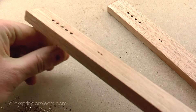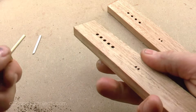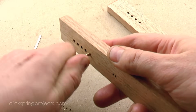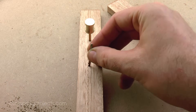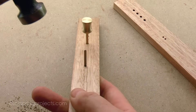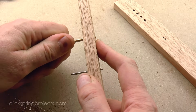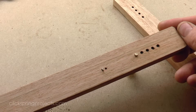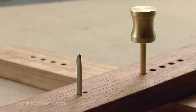The pivot can be easily repositioned within the trammel, and the depth of cut of the scorper can be adjusted by simply tapping it progressively deeper with the hammer as the cut proceeds. Now of course the spirals each have a slightly different geometry, so I decided on the least complex solution of a separate trammel for each. But it's not difficult to imagine a slightly more evolved version of the tool, closer to the modern universal trammel, that could plausibly have been constructed in the period. Regardless, it's a very straightforward and cheap set of tools to make. The big question is, how well does it perform?